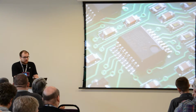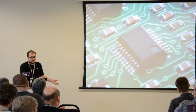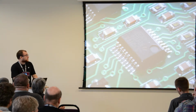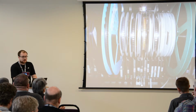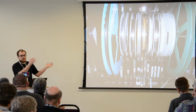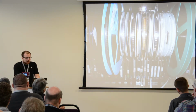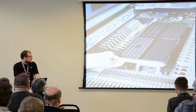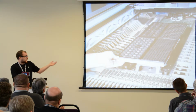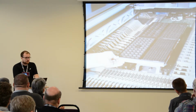Now, again, when you're tinkering, you don't really select components based on manufacturability, but when you're using these sorts of manufacturing techniques, you have to buy components in reels, and they come in little tapes so that they can be loaded into these awesome robots and placed on the circuit boards. Bigger items need to be purchased in waffle trays. They are actually called waffle trays. Again, the same principle applies. A little head pops down and puts it on the circuit board.